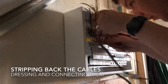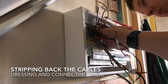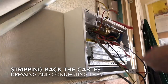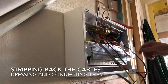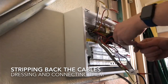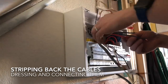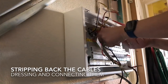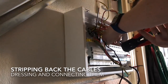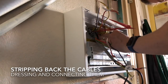Here I'm connecting all the circuits, but I haven't done any testing yet. Sometimes what I like to do is before connecting the wires into the circuit breakers I do the tests first - for example insulation tests before putting cables into the circuit breakers, which saves removing them again. Certainly the ring test as well - before connecting the two earths or two lives for the ring circuit I'll do a ring continuity test first, which saves disconnecting wires just to do the tests. But for demonstration purposes here I've just done all the connecting in one go and will go back and do the testing afterwards.